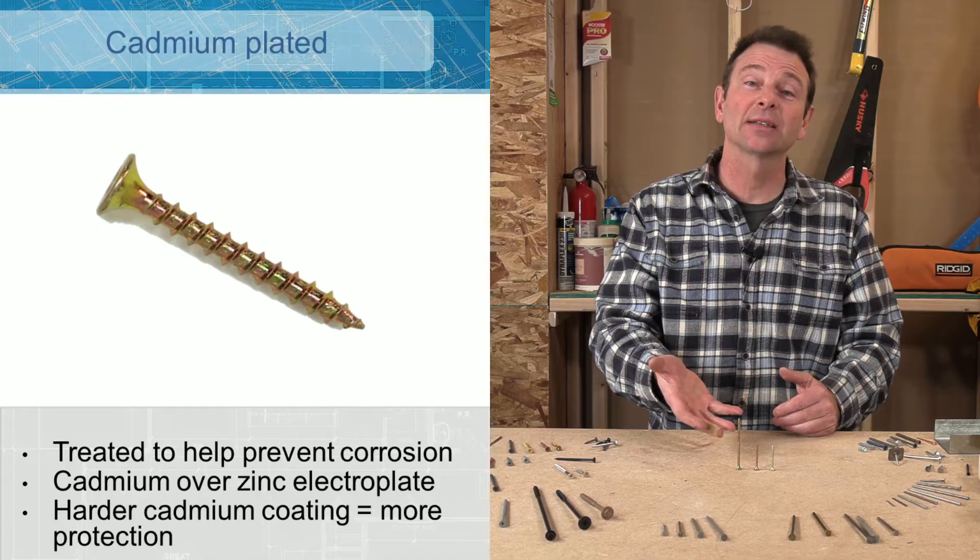We've talked about a lot of different fasteners here. I don't expect you to have memorized all of these different variations — honestly, it will take your entire career to learn about all of the hardware available. What you can take away from this is understanding the different parts: the head, the shank, the point, whether it's a nail or a screw, and start thinking about where you're using them, how you need to use them, the materials you're using them with, and how to do each job successfully by choosing the right fastener.